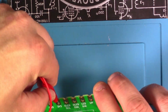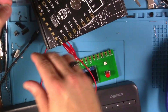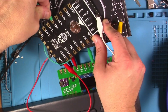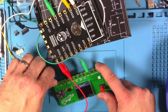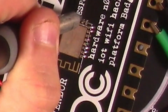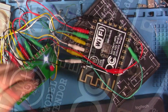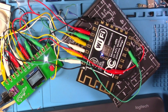After completing the SAO boards, I got back to the Gator and ESP board to wire those up with the jumpers as indicated in the instructions and try to push some code to it. I had a heck of a time getting the code to work and drove myself crazy longer than I want to admit, but ultimately the problem was a solder bridge between two pins on the ESP. Once I cleared that out, the code ran fine and worked like it was supposed to.